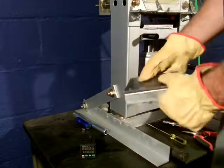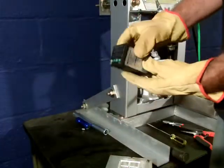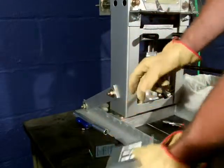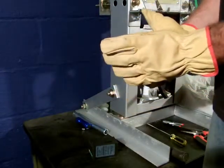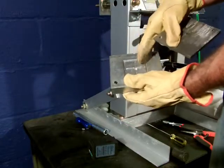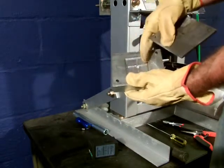In this video, I'm going to show you how to inject the faceplate. In this case, it's going to be for this electronic controller to go around the rim, but it can also be used in conjunction with any switch or any electronic device to go around the perimeter to close off the punched or etched hole. You have four runners right here, so the plastic enters from the middle and then it evenly gets distributed on four sides of this faceplate.